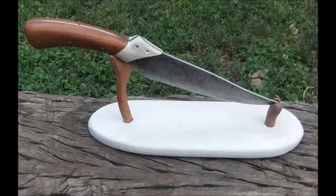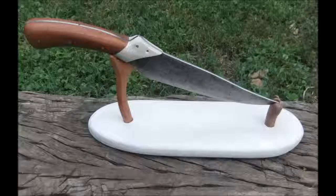This is one of the largest and certainly most well-composed knives to ever come out of the Screaming Goat Forge. The overall length is 13 inches and it has an 8-inch blade. This one specifically was heat treated by hand. I used the forge to heat it, used a magnet to test to see if it was to temperature.